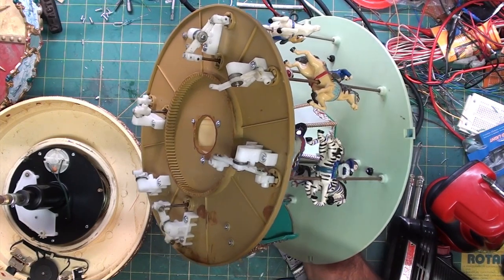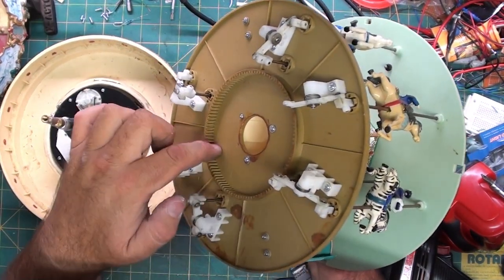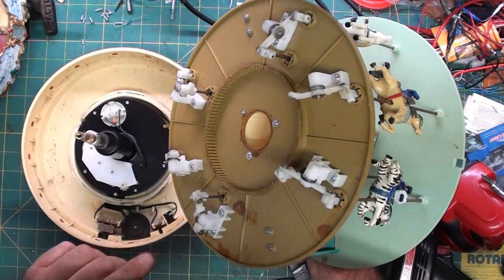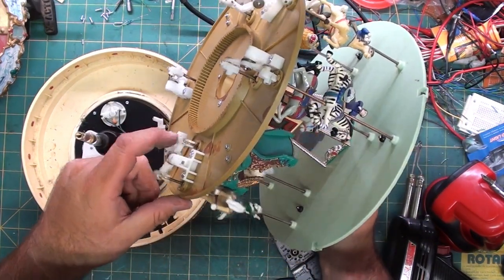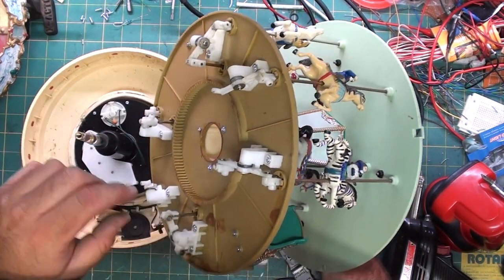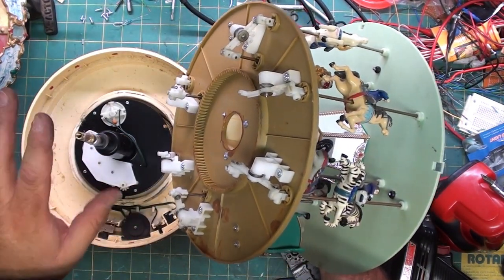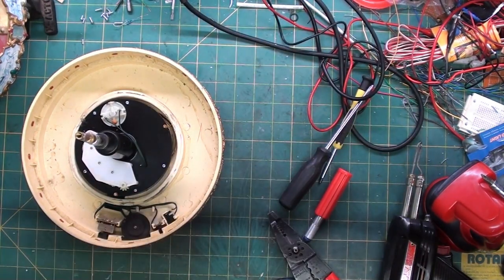Here's how it works. The gearbox down here spins an inner track gear here. You can see it's raised and lowered, which these then go on, which causes the things to go up and down. So very simplistic, very reliable. And the grease is a little sticky. We're probably going to clean all this out and re-lubricate it. Especially since it's part of an outdoor display.